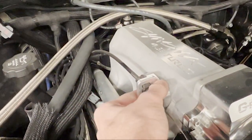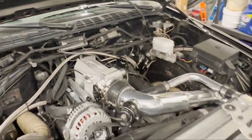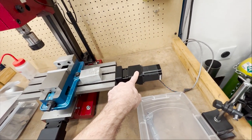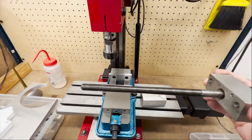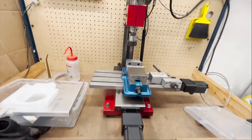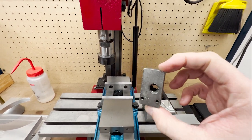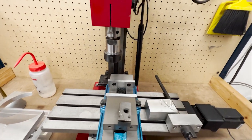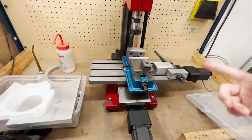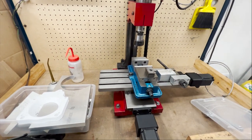I really thought that the CNC needed some upgrades after that, but I just wasn't ready to do it at that time. I took the time now to actually get it done on both the X and the Y. I took out these old lead screws — I'm not actually sure what thread that is — just a steel rod. The original piece threaded into just another piece of steel, so steel on steel. Sometimes I would wind up with one of the axes binding up if I tried to travel too fast. There's no feedback, and I would wind up losing position and potentially totally screw up the part.